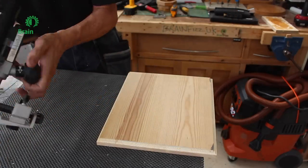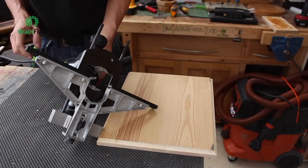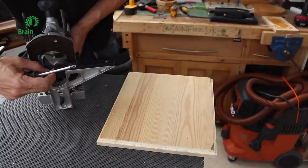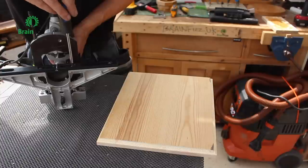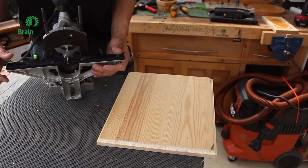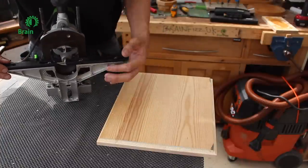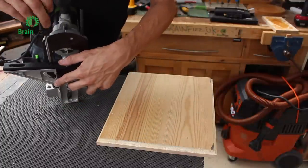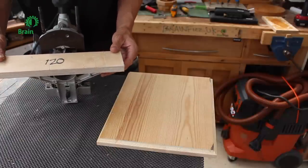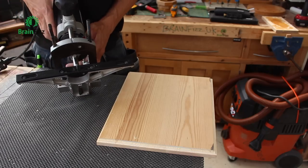The way around that is if you've got one of these fancier fences with adjustable side cheeks. I always consider these to be sacrificial, because they're easy to make out of a piece of ply. If you're doing a rebate and not using the full width of the cutter, back them up just a little to allow for the cutter space and give you the least amount of aperture to potentially fall into. If you don't have fancy cheeks, just screw on a straight batten to close it off so you've got a full straight edge to ride on — that's the make-do method.